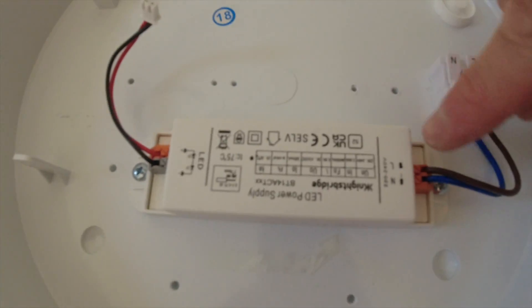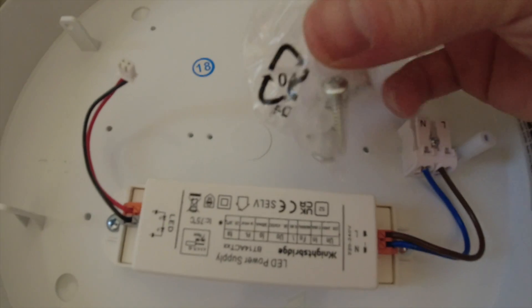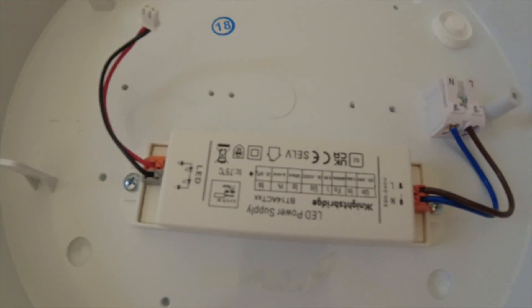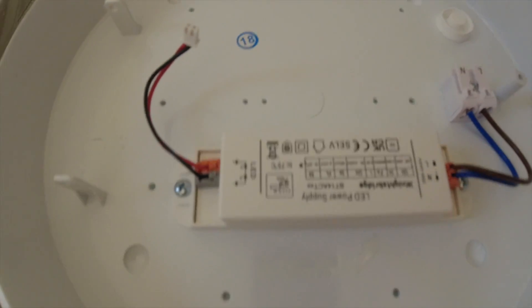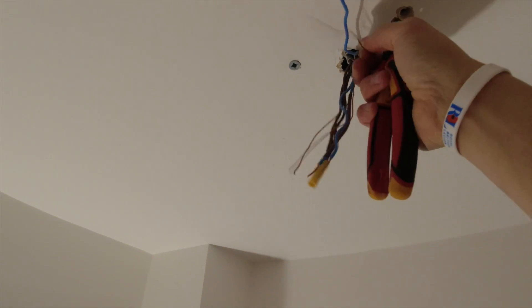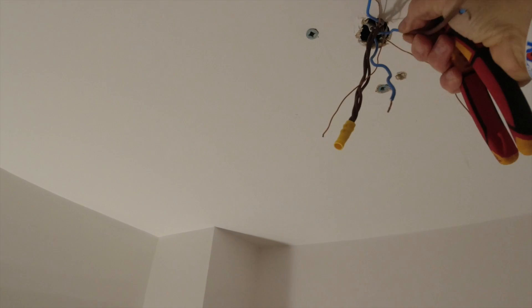The LED power supply is refixing really easily - don't even need a drill. I'm going to leave that one in there to give you an extra grommet. I'm going to drill a 20mm hole in there and bring the cable through, and leave that there just so there's no hole in the fitting. It is IP65, but obviously the back's not really that important - it's the front and the sides which are the IP-rated faces.